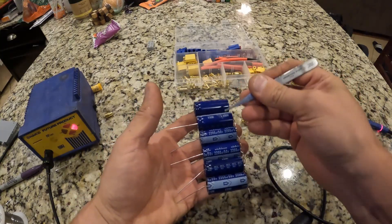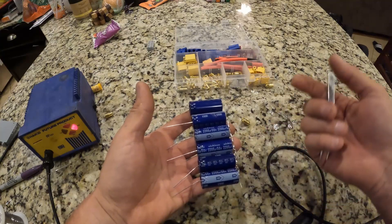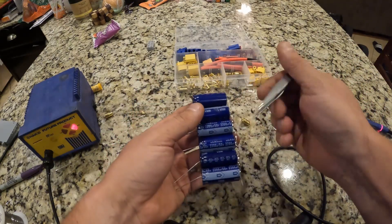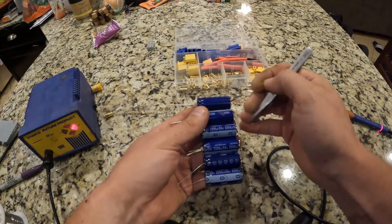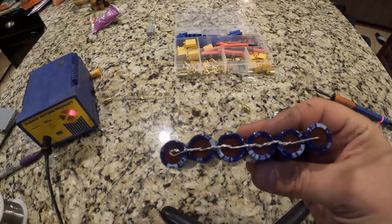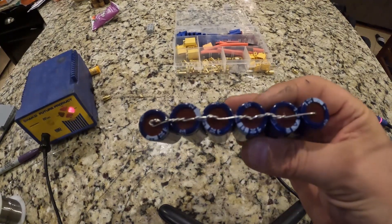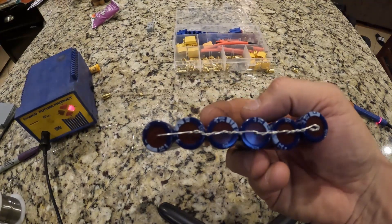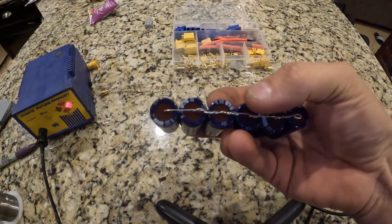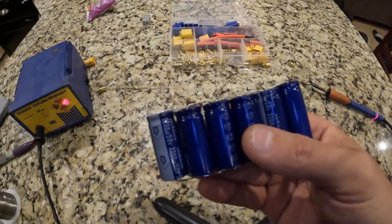Individually we have 2,200 microfarad. After we solder them all together, I'm going to get my meter and we'll measure the whole entire pack to see exactly what it equates to when it comes to capacitance. Here is the other side all wrapped up and weaved into itself. I'm going to put a bead of solder across all that, and then we'll take a measurement of how much capacitance we have, and after that we'll solder the wires.